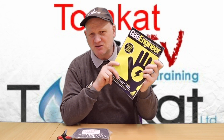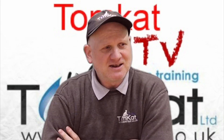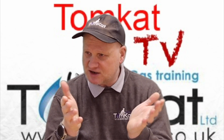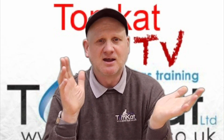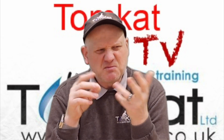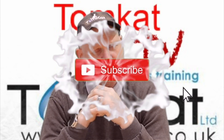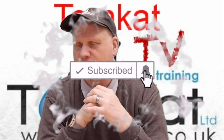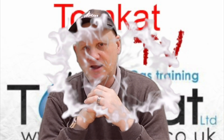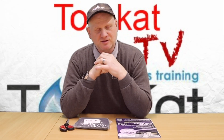This Technical Bulletin has been produced for your safety, not as a hindrance. And as you've seen from the video, hopefully it doesn't take that long to do the safety touch test. When you're going into the PCB or the openings of the electrics, you do your safe isolation. So when you're taking a boiler out or replacing a PCB, you need to do the safe isolation test. They're for your safety, not to make your day go four hours longer. It's so you go home safely.